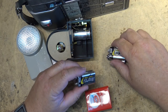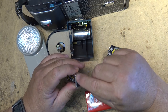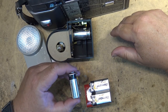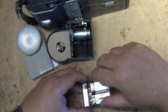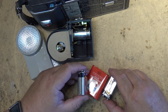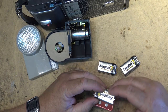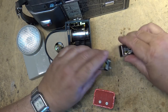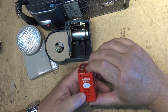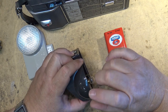So these batteries would have used the same type of cells that were used in the old 9-volt dry batteries. They're just a rectangular cell, and they'd be stacked. As you can see, they would have them arranged in such a way to be the equivalent of 5 9-volt batteries connected in series. So 30 of the individual cells. You'd have 2 stacks of them this way, right? And then double stack that way, and then one additional one would be in equivalent to this direction. There'd be a little bit of padding in here, I'm sure, a little bit of cardboard or whatever they use for packing the battery, just to fill the void. But anyway, 30 cells make up the 45 volts, and that's used to trigger the flash.